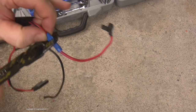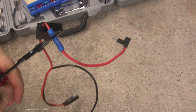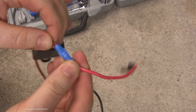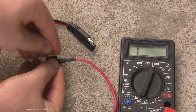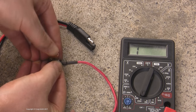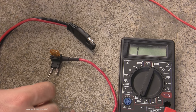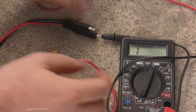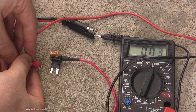Whatever you do, this is a positive feed obviously, so make sure that you have no exposed wires and no possibility of a short circuit. Now to complete this part of the cable we need to add a fuse — just a little 5 amp fuse, which is about right for the 3.1 amp max supply of the USB adapter I'm using. Then finally you should check your work at this point: check the connections, check that there's continuity from one end to the other.